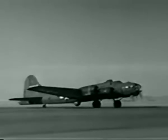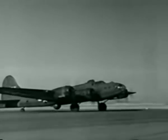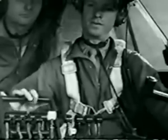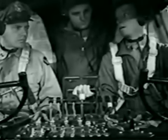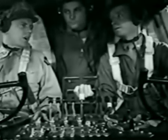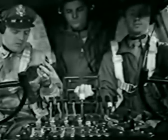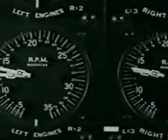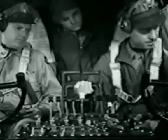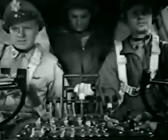Back to command to call the tower for takeoff clearance, and you're off to the races. Lock tail wheel. Hold it with your feet on the runway — less hazard if you have to get away fast. Set the gyro compass and check your compass heading against the heading of the runway. Gyro set. Generators on. Tail wheel locked — light out.